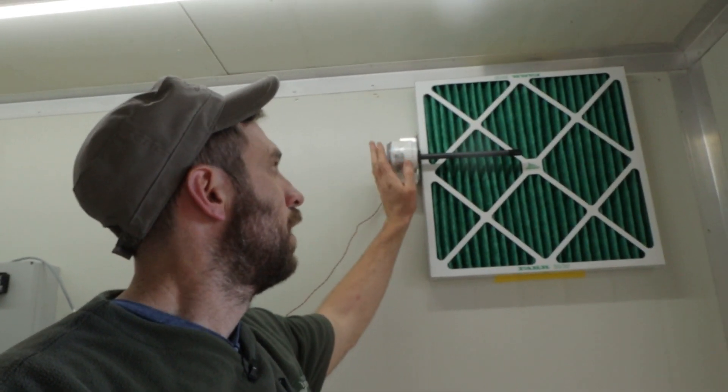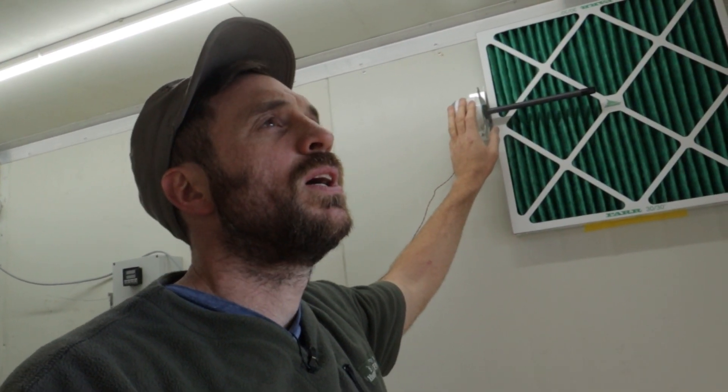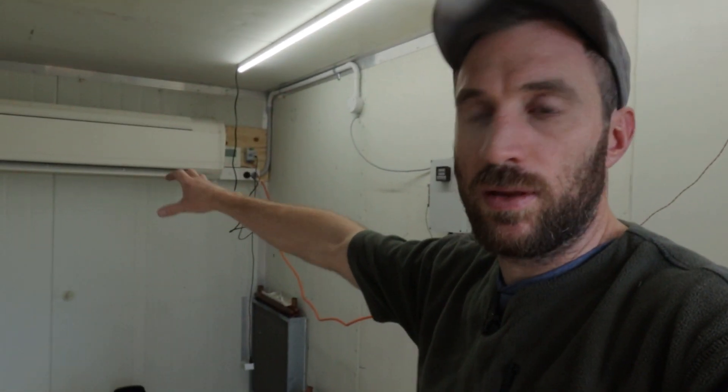So we're heating the air and drying it out, which is bad. The one solution — and it took me so long to figure this out — is to humidify in the pre-conditioning room with a little humidifier here. It's controlled by this American-made Dwyer humidity probe. We heat the air and humidify it, so when the air comes out into the fruiting room, it's not only warm but partially humid. You need to humidify to about 70% in here — you don't want to go too high because you don't want to overwhelm the heat pump. When the warm, 70%-humid air gets into the fruiting rooms and gets humidified from 70 up to 80, 85, or 90, it doesn't cool down much more and it helps retain the heat.